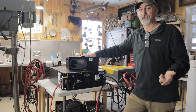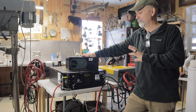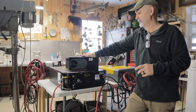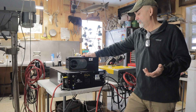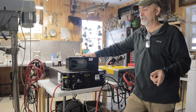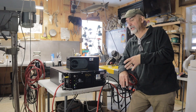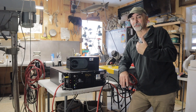To use the charge verter I have to run a dedicated 240 volt line from our generator into the camp. I was kind of undecided in the last video about what I was going to do, but because of the heating issues with these batteries - they have to be at a certain temperature to charge - I've decided to put them in the camp. I think it's a little bit safer in there as well. We'll have to run a dedicated 240 volt line from our generator house into the camp, so stick around for future episodes where we install this and hopefully work through any problems.